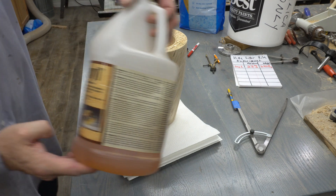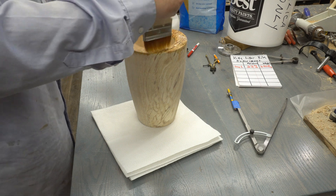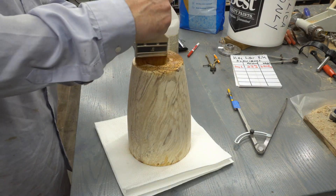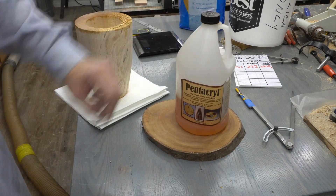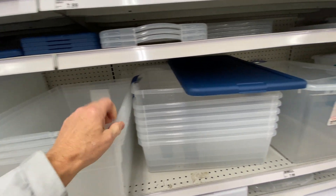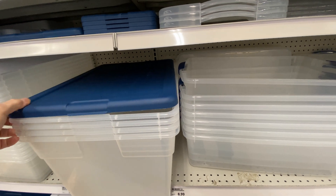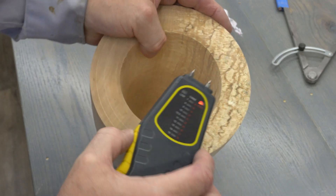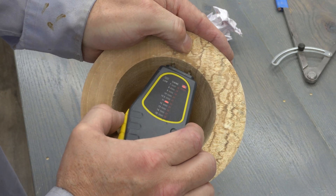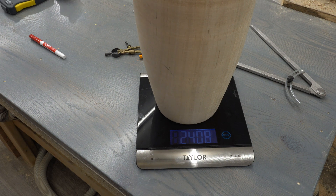With that backstory in mind, here's what we did. To help prevent cracking on the end grain, I brushed on a product called Pentacryl, which seems to do crazy things to wood to stabilize the wood fiber. This thin tree round was fresh cut and treated two years ago — no cracks, no splits. Next, we'll need an airtight container big enough to hold the wood to be dried. A standard five-gallon paint bucket with a rubber gasket lid is the ticket here. Let's take some initial readings before starting the drying process: our green wood vase will start at 22 percent moisture content and 2,408 grams.